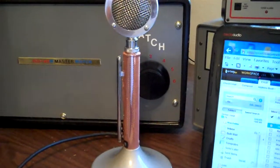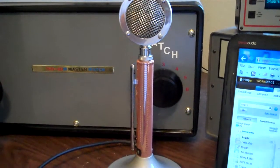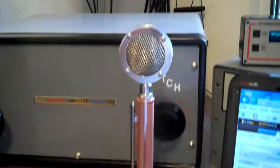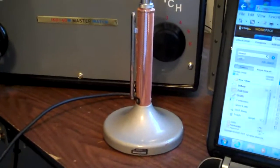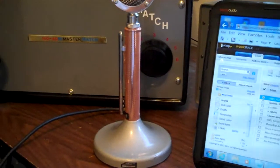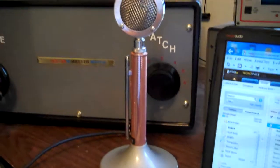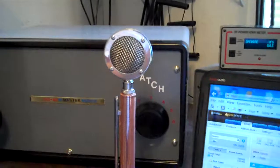Here's a video of my D104 that I used with a 2x4 transmitter. This is just an old beat-up D104 with a blown element. What I did is I put a Blue Spark studio microphone inside this. The board for the Blue Spark studio microphone is mounted in the bottom, and then the condenser element is mounted at the top.